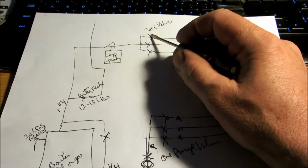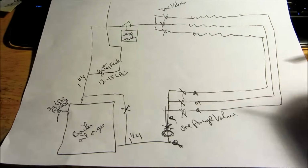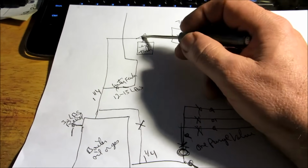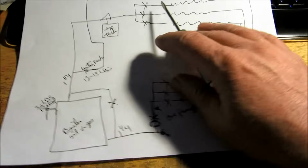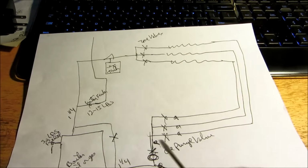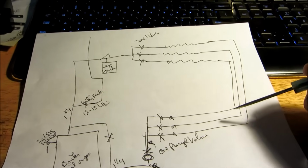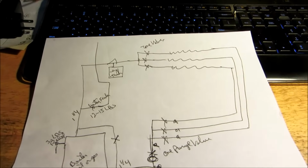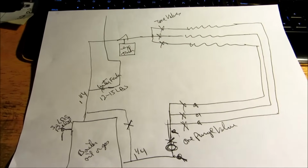restore these zone valves back to operational position, and you'd fire it up. And the boiler would heat up, the water would expand in the expansion tank, you'd get rid of the air out of the high vent. This has already been purged. As long as you got a good, steady system full of water, it will circulate. A lot of times you'll hit air in the lines, or it needs to be purged, or it's not heating properly. You might have air in the loops. So that's basically it with that one there.